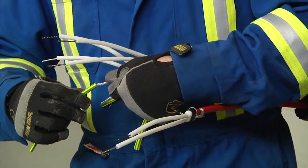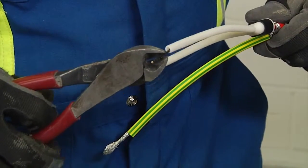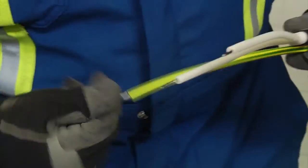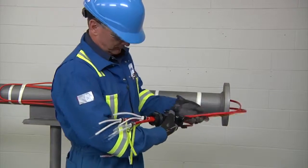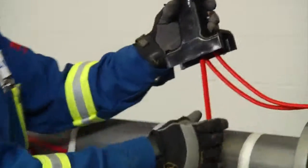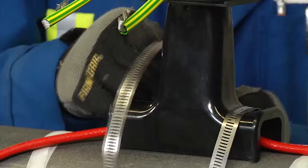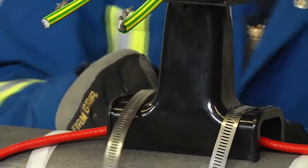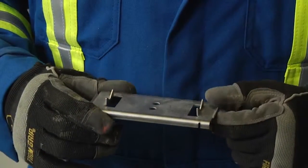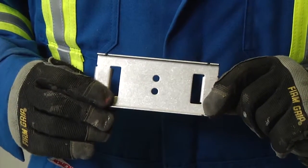Slip the green/yellow tubes onto the braids. If needed, trim bus wires and braid leaving one half inch (13 millimeters) protruding out, and pull the heating cable back into the stand so that one inch (25 millimeters) is exposed. When fastening the stand to the pipe, use the appropriate number of straps indicated in the installation instructions. A small pipe adapter can be used for one inch pipes or smaller.